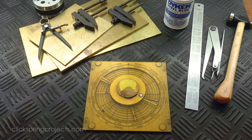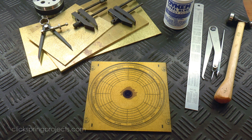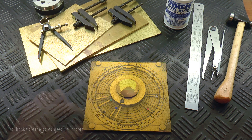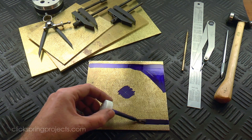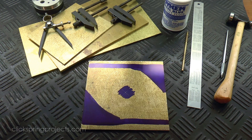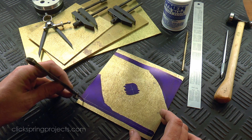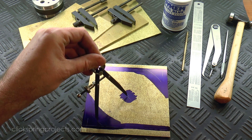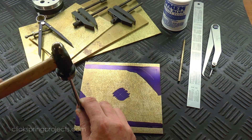But there are some constraining factors affecting placement that become apparent when you look underneath the top plate. The subplate is shorter than the upper dial plate, reducing the common area to less than what you can see from above. The four pillar locations also occupy some of the space, and of course the center of the upper plate is largely occupied by the main display rings. So the available space comes down to quite a small triangular shaped area, just inside from each of the corners. The pins can go anywhere inside that space, and to some extent it's preferable that they be a little asymmetric, so that the plates will only match up one way. But the area does need to be clearly identified before I start making holes. So this is the space that I have to work with, and a quick punch marks out where I'll drill the holes in a moment.